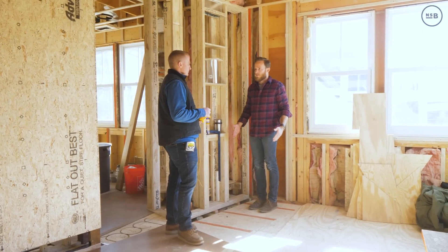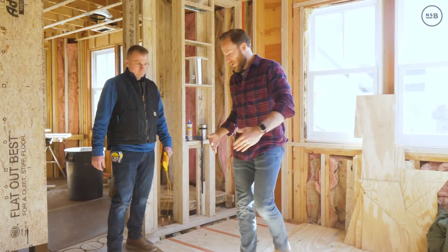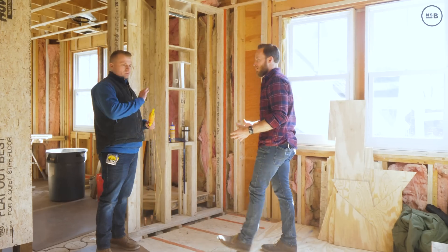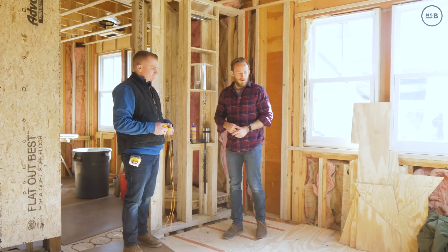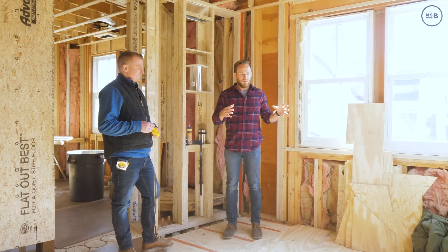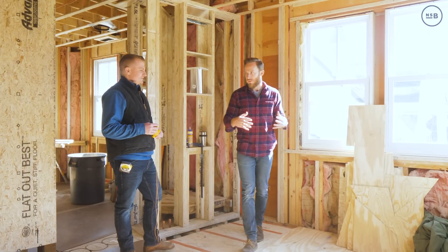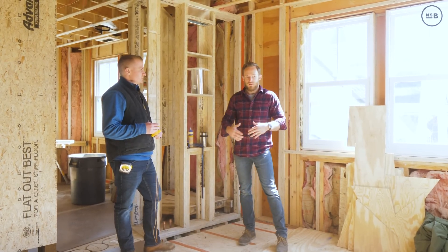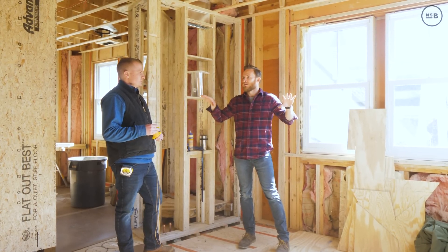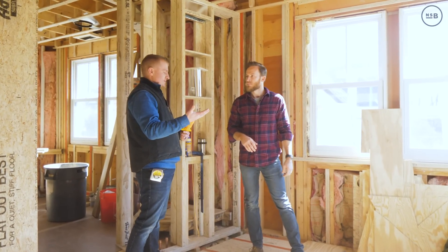This isn't a real big spot for drainage — we're going to have multiple shower heads — but we have the advantage of the shower having a big piece of glass to encapsulate the space, and a tub in the corner. We have everything working against us, and it's really important that we're working with one system — Schluter in this case — making sure we have a completely water and vapor tight system.